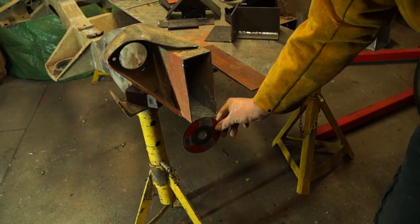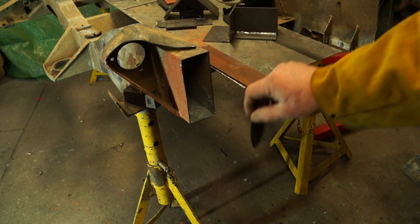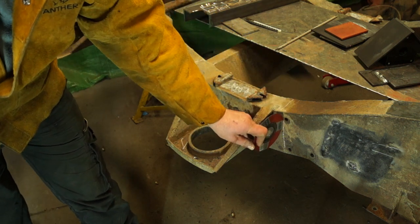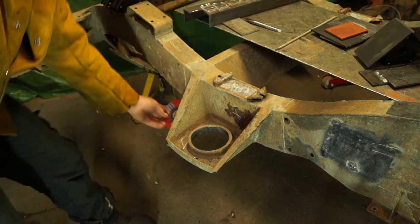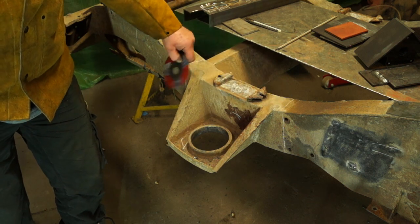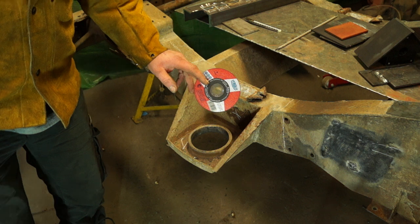Planning cuts are really important. When I cut the chassis I took four cuts and the chassis rail was cut in half with one of these discs at one mil. There's one cut, the second cut upwards, third, fourth, then along the back here fifth, and along the seam sixth — the whole lot can come off in one go quite easily. The aim is to save on materials, cutting discs, and electricity. We're using one millimetre slitting discs which are good enough.